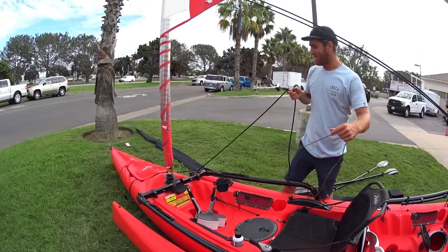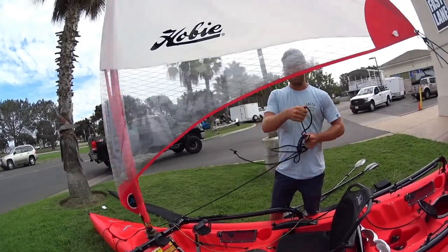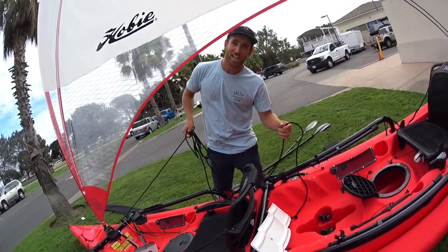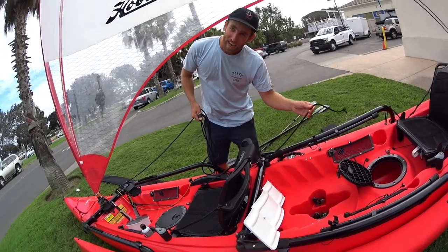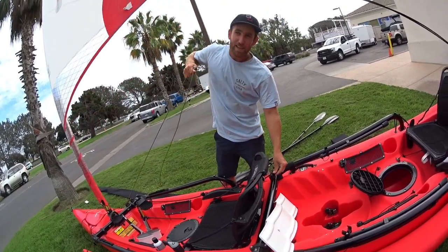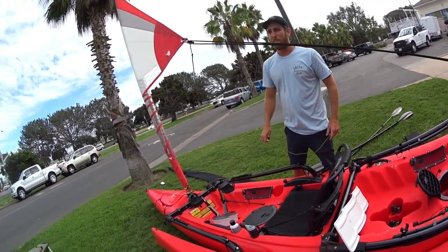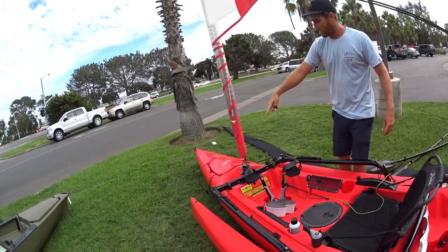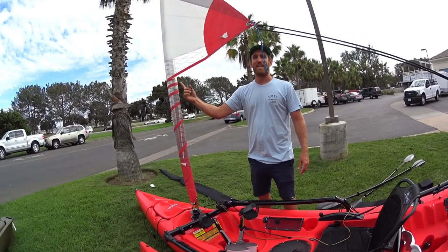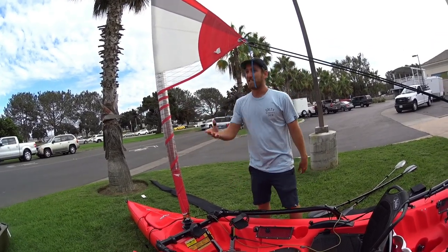Sometimes say the person in the back opened the sail and sheeted it in, and the person up front tried to sheet it out — and that got locked in. When you're ready to pull it back in, uncleat and pull in the yellow one. If it bottoms out you just need to let out more main sheet, then the person up front does that. It's common to have some left over because the way it rolls up goes by number of spins — so even if it rolled tight, there's still some left over. You can do it by hand or wrap it up.